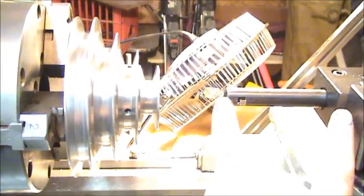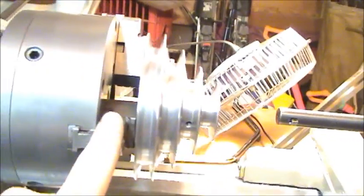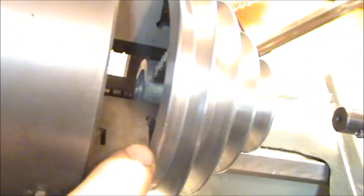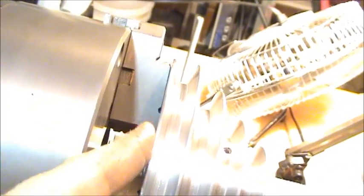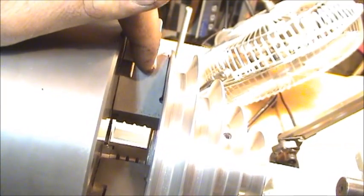All the way down to the outside, so this distance here is set to be able to clear the inside of this pulley. The jaws are bearing on that center boss right there — that's what's holding everything. This flat end of the pulley ends up being perfect to line up at the flat end on these jaws so that it's not canted either way.